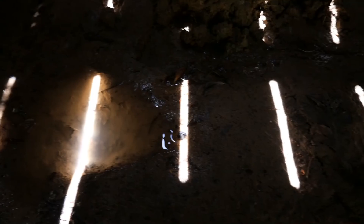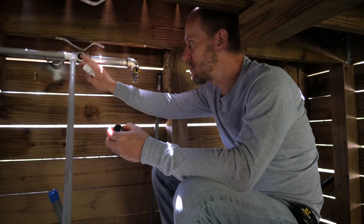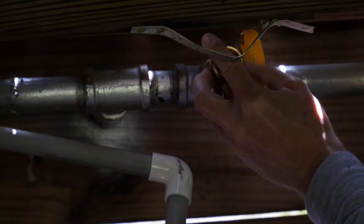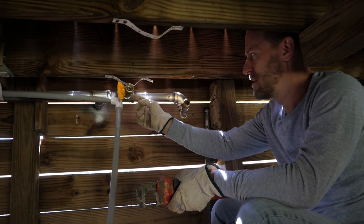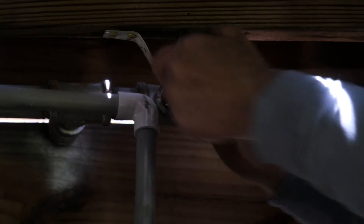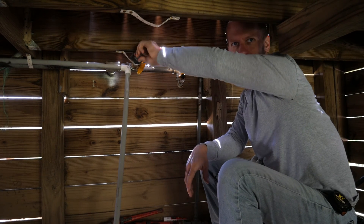This is where I'm going to tie into the existing gas line. This is Teflon pipe dope — a lot of times I just use yellow thread tape. You can put on more than one fitting: I did this nipple and then this valve, and you turn the back one and it threads through and tightens up. Then I'll put a plug in here, and in the future if I want to connect anything else, I just pull the plug and connect to it.